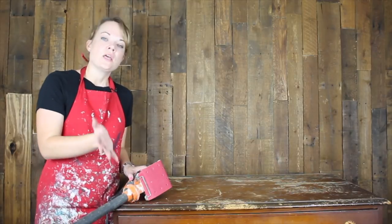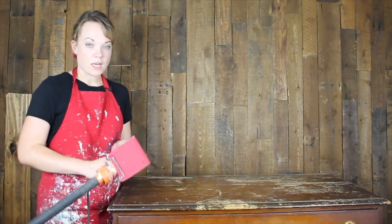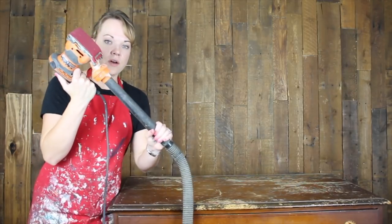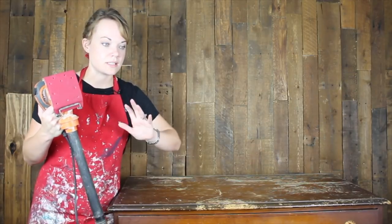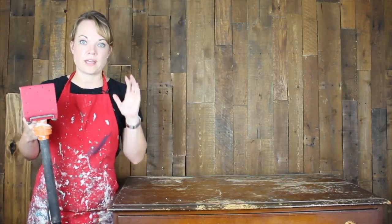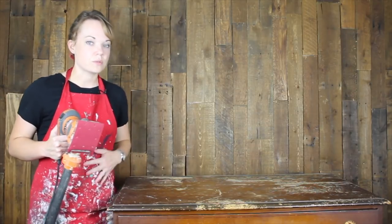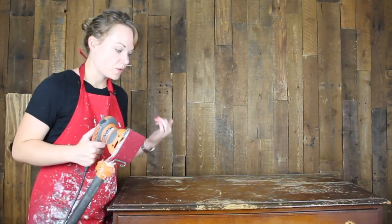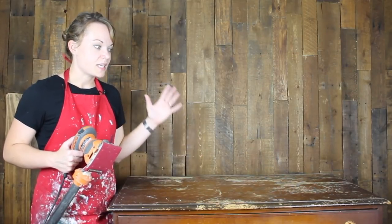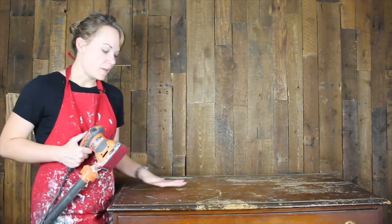So I like to start with 120. If it's not moving fast enough we'll move up to 80 grit; if it's going okay we'll strip it with the 120 and then smooth it out with 220. I've got that loaded up on my pad sander. I'm working in my garage and a little trick I want to show you is I like to hook up my pad sander to my shop vac — the hose just fits right in the back, it collects all the dust and really reduces the amount of dust in the air. Since we're inside, always work with good ventilation, and if you're worried about lead paint or anything like that, wear a respirator so you are safe. We always move along with the grain, and stop periodically to change your sandpaper if it's not working as well.